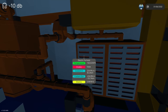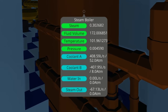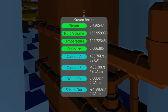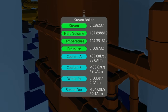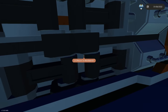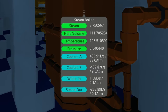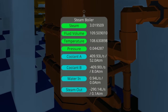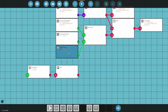Temperature comes up really quick — 150 on the electric furnace basically instantly. If I can hold around 120°C on the boiler I think we'll be okay. I want high pressure because pressure is what determines the speed of the pistons. It doesn't look like the temperature's going up much — around 105, going up slowly. All the pistons are moving very badly. The pressure dropped, and I wonder if it's because a lot of steam got sucked out of the boiler.